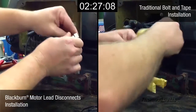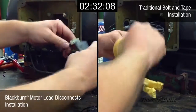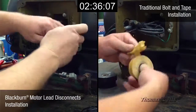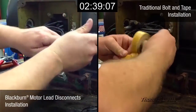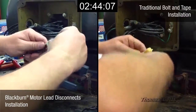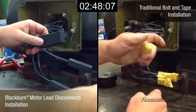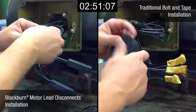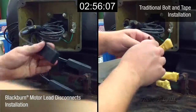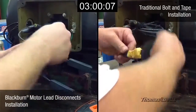Motors, motor controllers and related equipment receive regular preventive maintenance and testing. Most tests are performed with test probes connected at the motor controller. However, if necessary, a motor with the quick disconnect arrangement can be quickly isolated from the controller. The insulating boot eliminates one installation variable — the skill of the installer assigned to tape the connection. Moreover, there's less chance of failure due to insulation breakdown from heat and vibration. When disconnecting the leads, the boot also eliminates cutting away of insulator tape. Since a knife isn't used, the motor leads can't be damaged.